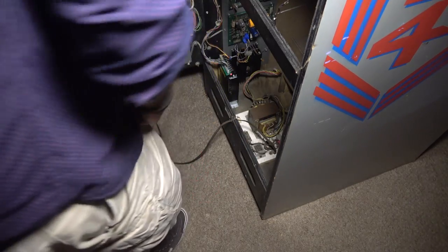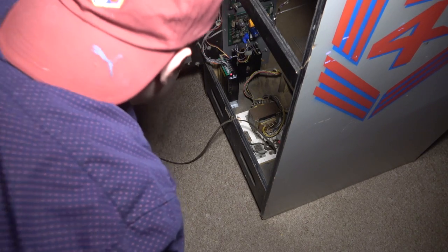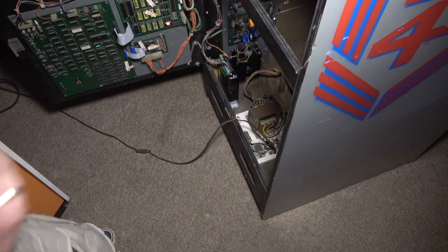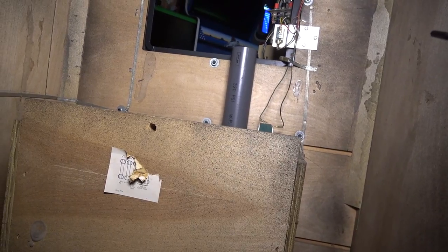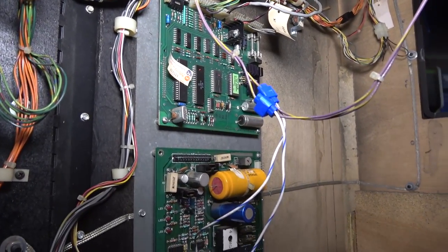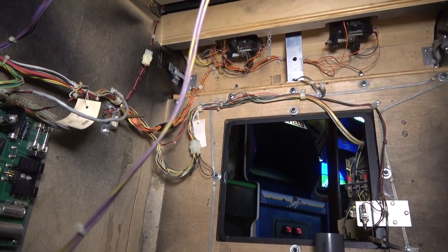All right, well, yellow and white are, though, and there's 5 volts getting to them. Just one of those stupid little tiny things that's gonna drive me crazy though, because it's like, where is the voltage going? So if we come down in here and scope things out. I'm just looking around here. Yellow and white. So the yellow and white wires are coming up through here. They're staying in the bundle. I see them in there. And then they're basically just getting to that Molex over there.